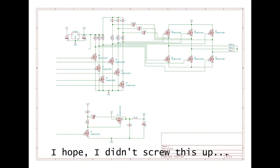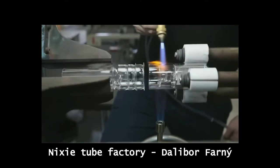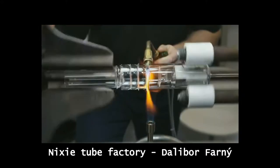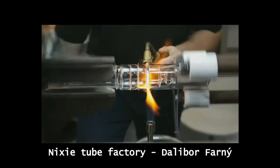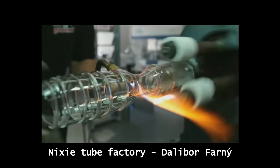I have 3 Hall sensors and 12 magnets. I am sensing only one polarity, so that's 36 positions per revolution. That's not very fine, basically. For my application, this may be sufficient, because I'm not as much concerned about the speed of the motor. What I need to do is to maintain the angular position of two motors relative to each other.